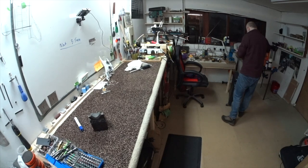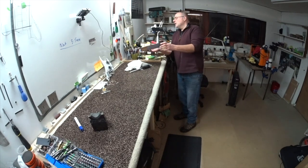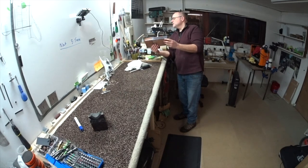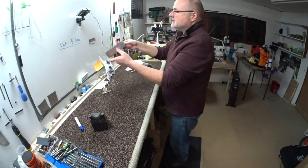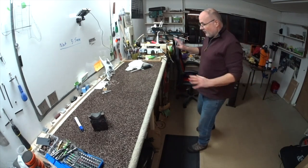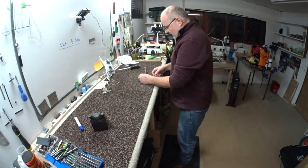Okay. The reason I had the buffer out is because this is my test piece where I did some waterborne poly on here. Can you see yourself in the mirror? Some sort of. Yeah, waterborne poly. And I got to buff it out today. Pretty impressive. I don't know how many coats, maybe 6 coats or something. Very light coats, but that's really excellent. Done in these conditions, not flatted back properly either, so I wasn't really worried about that. I was just conscious of, holy cow.